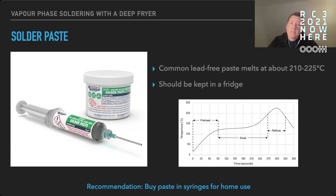All solder paste comes with a temperature profile that tells you exactly how many seconds you should ramp up the temperature to a certain amount. Then you have a soaking phase where for several seconds you keep the temperature at the same point, and then for a very short time you ramp up to the reflow phase — that's when the actual soldering happens — and then you remove the heat to cool it down.